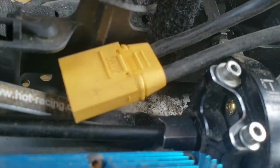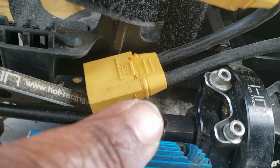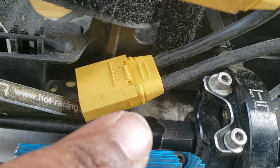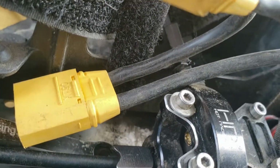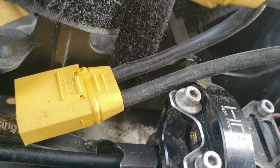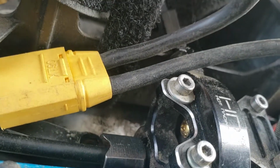They're stainless steel, I believe, and Loctite is not holding on to it, so it's backing off. So I ended up using red Loctite. Hope that holds it, because the coating on there is super slick and is not biting. The Loctite is not biting onto the aluminum that's on the thread. So I put new screws in, red Loctite, so hopefully that solves that leaking issue.